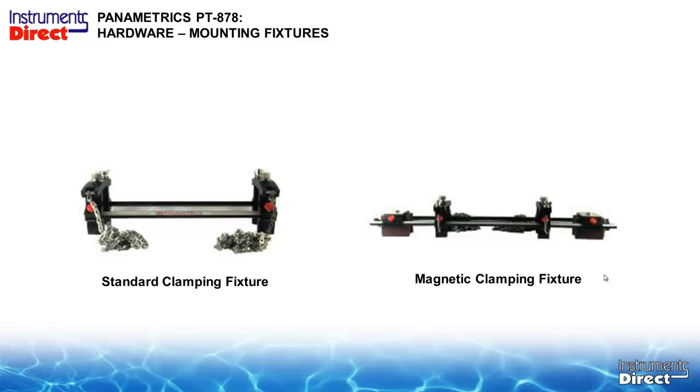The standard clamp fixture comes in different package sizes: 12, 24, and larger. Note that 12-inch rulers fit in your carrying case — anything larger does not, which is why spare rulers are sold separately. For applications with a lot of large metallic pipe, the magnetic clamp is a nice tool. It is the same standard clamp fixture with an additional 8 to 12 inches on either side holding magnets. It is a large transducer, but useful when walking from pipe to pipe on 24-inch applications. Take note that the maximum temperature rating of the magnets is approximately 140°F.